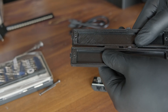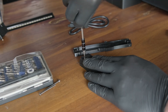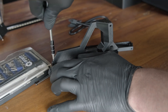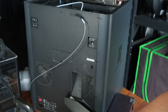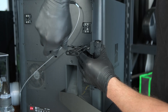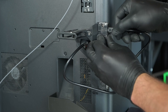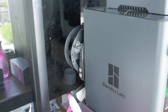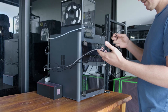Once you have the working part printed off, let the self-tapping screws do their thing and screw them in. You'll be drilling them into plastic, so this will take a little bit of elbow grease. Once you've screwed them in properly, use the other two self-tapping screws for the side. Now remove the spool holder — don't worry, we're putting it back on. Place the two remaining long screws in the branch assembly and place the spool holder on top, then screw it in. Take the cable from the box and connect the AMS port to the top-in port. I ended up zip-tying the cable to the back of the printer to make it look a bit cleaner. Now you have plenty of USB ports on your printer.